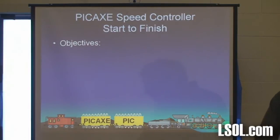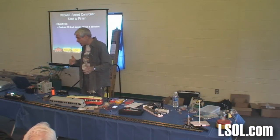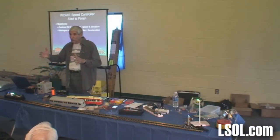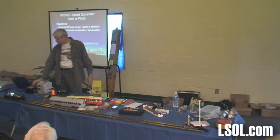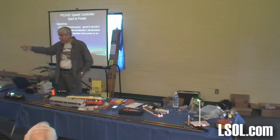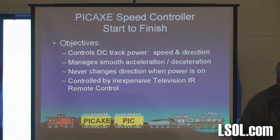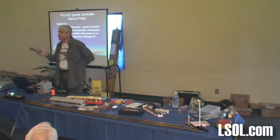We're going to build a controller from start to finish. It's going to control DC track power, just as we had the trolley going back and forth before. It's going to manage smooth acceleration and deceleration — some point-to-point controllers just turn the power on, bang, it goes, then turn the power off, bang, it stops. We want it to be more managed than that. It never changes direction with the power on — you don't want a train going 40 scale miles per hour and suddenly going 40 scale miles an hour in the other direction; there are little things called gears that don't react well to that. And it's going to be controlled by an inexpensive TV remote. These remote controls have to be set to Sony — that's the most common setting — and it'll run these things beautifully.